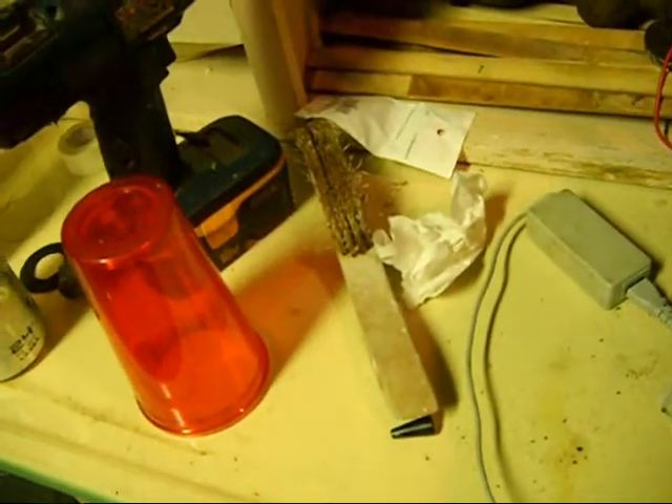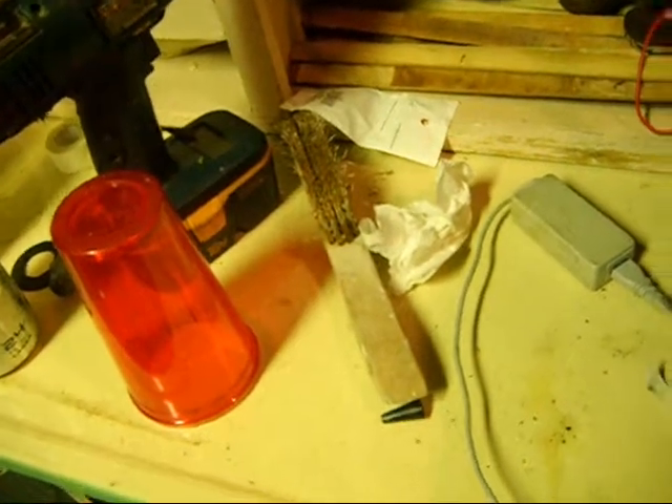Normally I would have knocked off a lot of that rust and flaking stuff with wire brushes first, but I wanted to show you the condition it was in without touching it, then put it in the electrolysis and see how it reacts. Another important point: your sacrificial piece of metal and your target cannot touch. Basically if they touch, it's going to cook your converter and not do anything you want it to do. So let's let this cook for a little while in the soup.